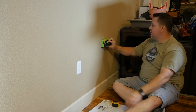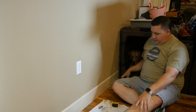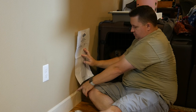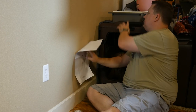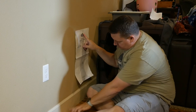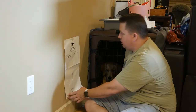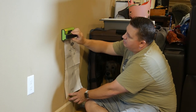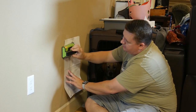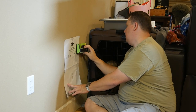We should be about 16 inches on center, so the next stud over is right here at the carpet line. Also, I don't want to mess with the baseboards, and these frames have a flange around the outside that's an inch and a half big. So I'm gonna go at least two inches off of the baseboard before I put up my template. And then my stud is right there and right there.